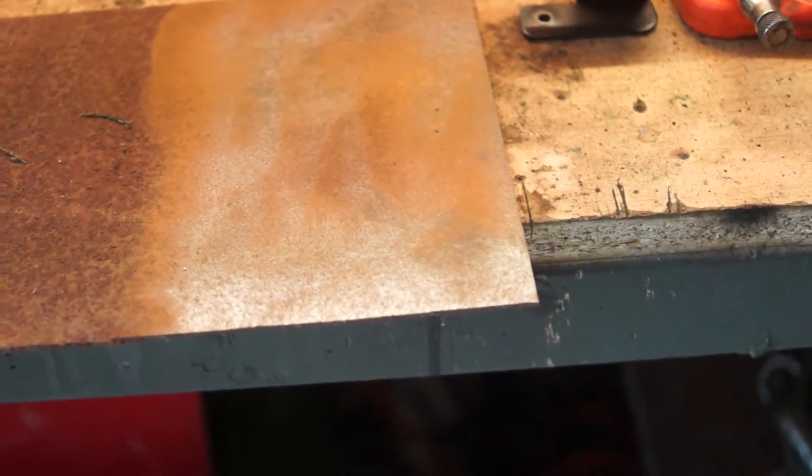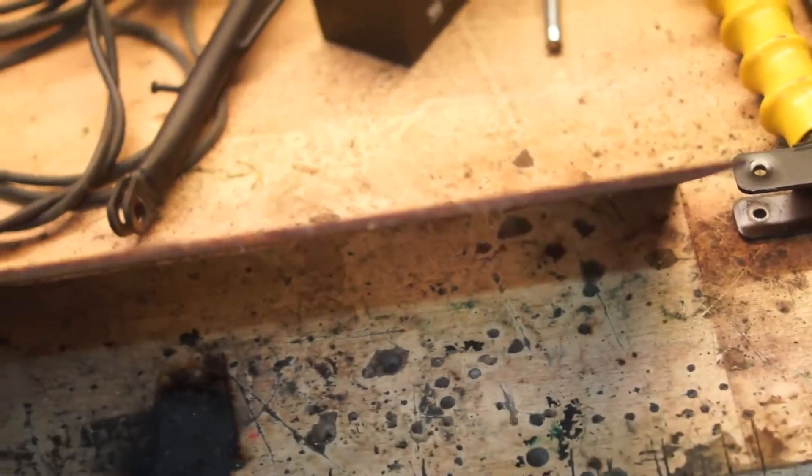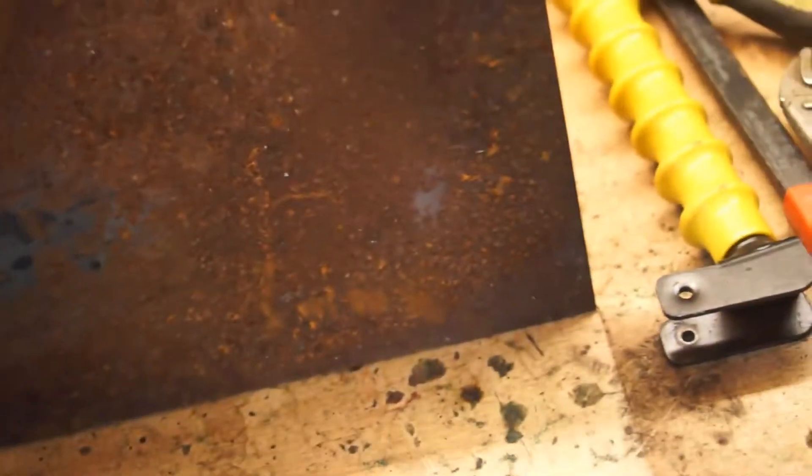I found this rusty old piece of steel. I'm going to use this to bolt my motor to underneath. It's quite thick. It does look rusty but with the electric drill I'll clean it up, cut the six-inch square I need. I'm going to either flappy-pad it back to metal to get rid of the rust, or clean it up with an electric wire brush then put rust converter on it. It's going to get painted anyway, so I basically just need a six-inch square to mount the motor.